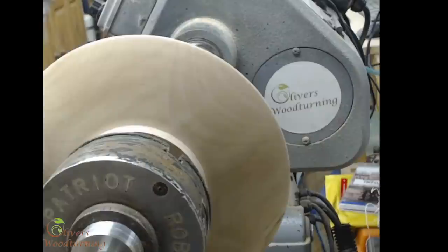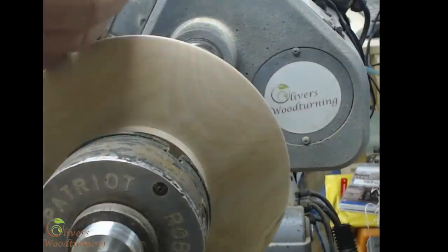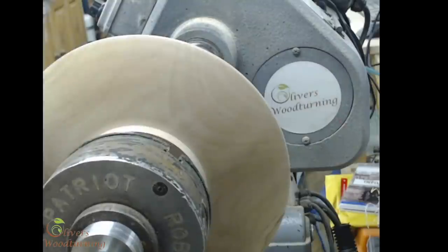So about 3 CFM, and on the gauge there, whatever this measurement is, 2.5 is the minimum that you need. So my Bambi at 2 just holds it, but I'm not happy with it. And it's on the big compressor. So 2.5 CFM minimum. I say 3, most compressors run at 3 or 4.